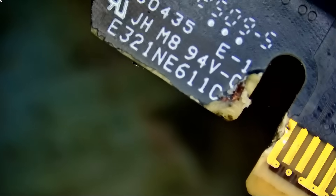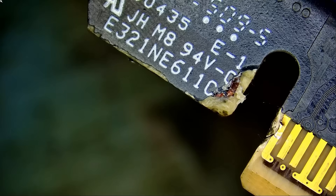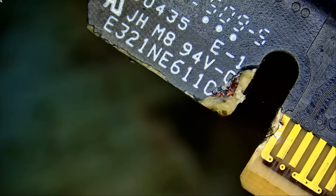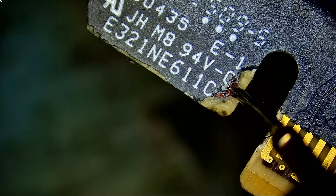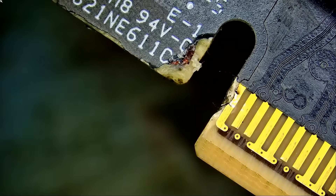Let me flip the card and check the back. What do we have here? Looks like some type of wire — maybe it's ground. Let me measure quick. I pray and hope that this is ground. Meter in diode mode or continuity mode, whichever one you want. And if we measure... yes, ground. So we can UV mask it, hide it. And this guy here is ground also, if we measure from here to here — ground. So this is ground and this is ground.